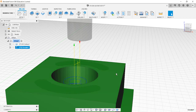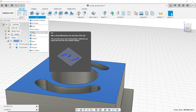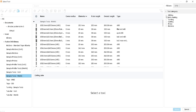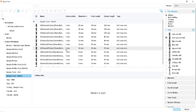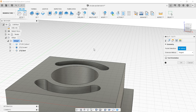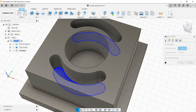The next operation remaining is a circular slot. I'll select slot operation and choose the tool. The key here is that the tool diameter should match the slot diameter. The slot diameter is 10 mm, so I'll select a bull nose end mill of 10 mm for low carbon steel slotting. Then for geometry, I'll select the two slot faces.